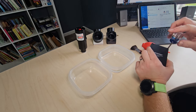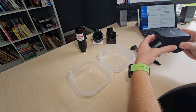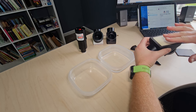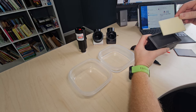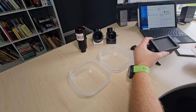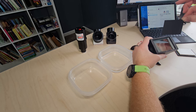I'm finishing up taking out the last screw. Naturally there's nothing holding the mirror into the diagonal anymore, so hold the diagonal like this when you get the screws out. Sometimes these covers can be stuck on, but this one lifts off really easily. They'll all be different in the way the mirror is held in — in this case there's some foam in there. Remember how it all goes because it'll influence alignment. I'm flipping it over and placing it on the cover so I know exactly how it goes. There will often be paper or cardboard shims in there — don't freak out, that's normal.